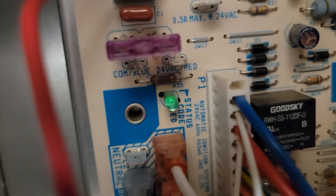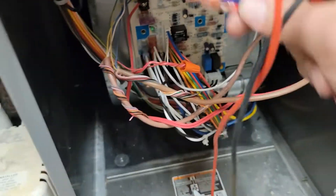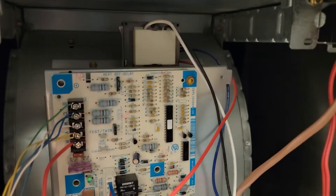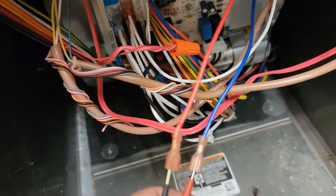These are the two wires — let's pull these off. We've got a red and a blue, common at 24 volts AC, and they come from the transformer. You've got 120 volts in, white and black. 24 volts is our control voltage, provided by our step-down transformer. With the leads hooked to both wires, we have 28 volts, so we've got voltage coming from the transformer to the board.